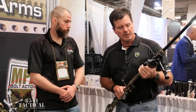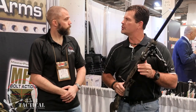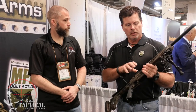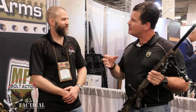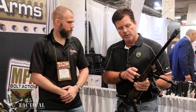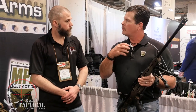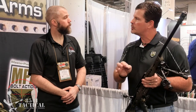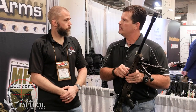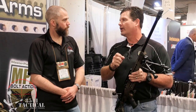Because the hunting applications are so wide and vast, we didn't really want to shoehorn ourselves into some specific limitations where a consumer may want something a little bit different. And because we make the barrels in-house, we do the drilling, the reaming, the rifling, the hand lapping, the stress relieving, the contouring, the chambering. We do all that internally. The limitation is going to be the chamber reamer. If there's a chamber reamer made for it, we can create that barrel.